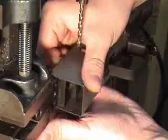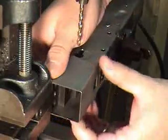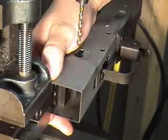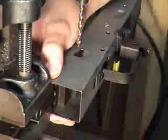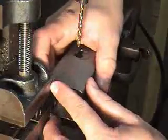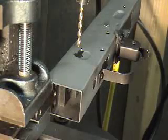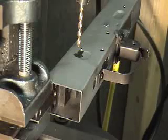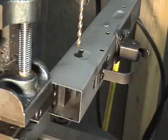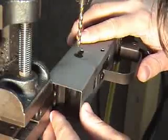I'm going to have to spread the receiver a little bit for this one. If I were building on a flat that I bent myself, I would be doing this step very last after I press the barrel in. This is an Armory USA receiver — both these and Nodak Spuds I've had very good results with and have never had to correct any of them. If you're doing this on a flat, you'll probably want to do this last because it can actually affect your spacing with your selector lever to your top cover, and more importantly the top cover to the rear sight block. Some of them are so off-spec that the top cover won't even close. If the receiver is too short by a few thousandths, that's generally not a problem, but too long you'll have a problem because then the receiver won't lock into the front sight block. So this is level — it's about where I want it. I'm going to go ahead and clamp this and we'll get going.